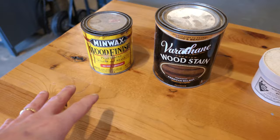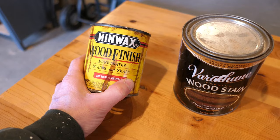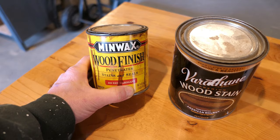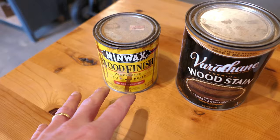You've probably seen some of these products at Home Depot or Lowe's. If you've done staining in the past, more than likely you've run across Minwax Wood Finish or Varathane Wood Stain — something like this. It has a very light viscosity, almost like water. When you apply this to the wood surface it soaks in, and that's what gives it the color. However, these don't work very well when you're trying to do a very dark finish. They work on certain woods better than others, but they're not going to give you a very deep or dark finish.